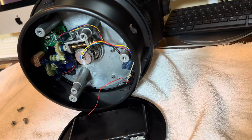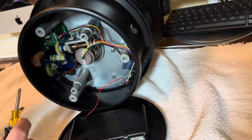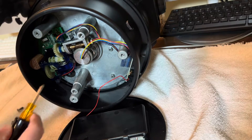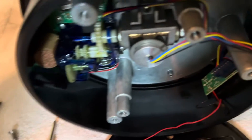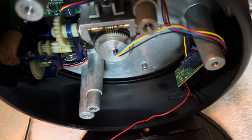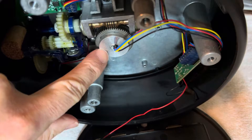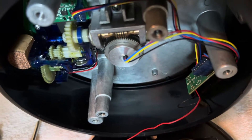The next part — if you see this, this is the worm gear. This down here is the lever up top. If I move that, I loosen it and tighten it. You can see that that bolt is turning in there. Basically that turns and tightens the clutch parts together, so the round disc should stay in place and that bolt just turns and tightens a little bit and pulls everything together.